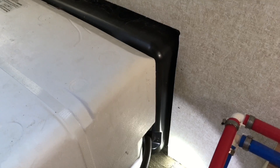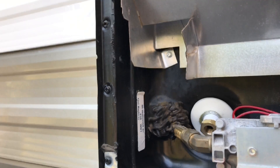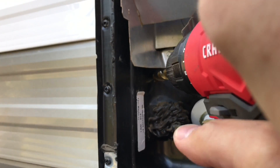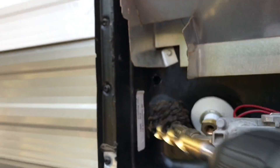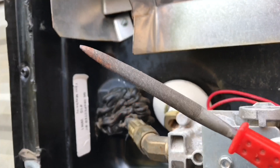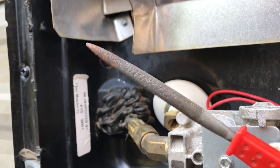Now let's take off the box. Now I have a better understanding of where things are. Removing the couch really opens this up and gives a lot of options. You can tell this is where the gas line is — right there. What I'm gonna do is just right above, about right here, and drill my hole — half inch. Let's drill a hole.